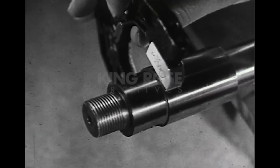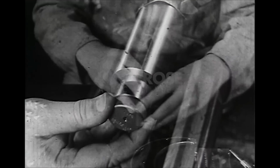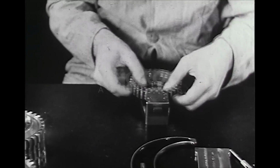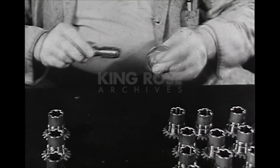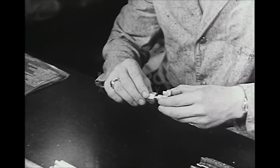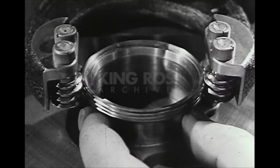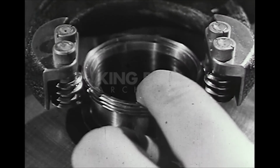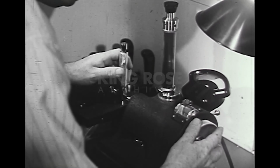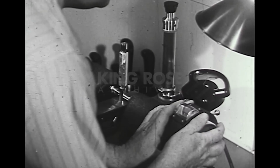Mass production depends upon fixed gauges for quick and accurate gauging of interchangeable parts. Constant inspection of products must be maintained to assure the precision required for interchangeability, and for this reason, fixed gauges are the special tools of the inspector. The gauges employed for inspection must be used with the same care as those used for gauging work while it is being produced. But careful use is not enough. All gauges must be checked periodically with master gauges or gauge blocks to determine their precision.